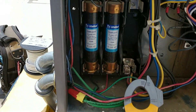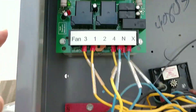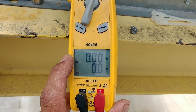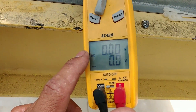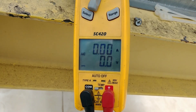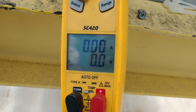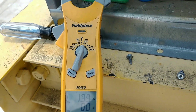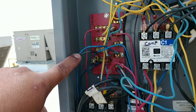Alright, we just came out of defrost - as you can see we're in refrigeration mode. Our time clock is still in a defrost state up here, but we're in refrigeration mode. The fans currently have no amp draw, which means they aren't on yet - we're pulled in, but the only thing keeping our fans off is the time delay. In a few seconds, once that coil reaches 25 degrees, we should start seeing our amp draw, which means the fans kicked on. There it is - the fans just kicked on! Fan delay verified working, defrost termination verified working.